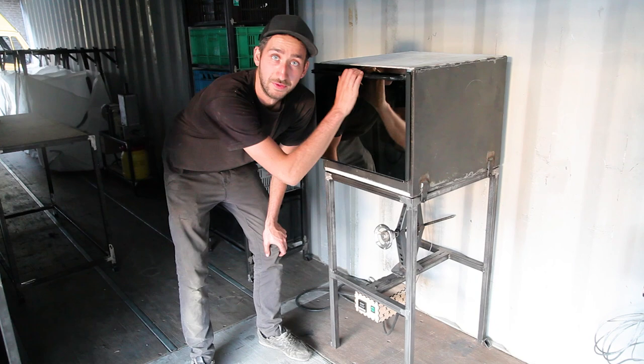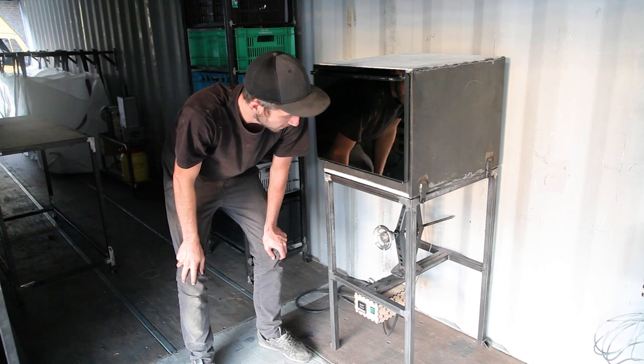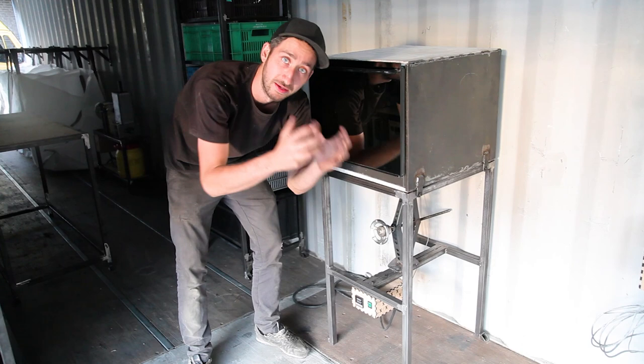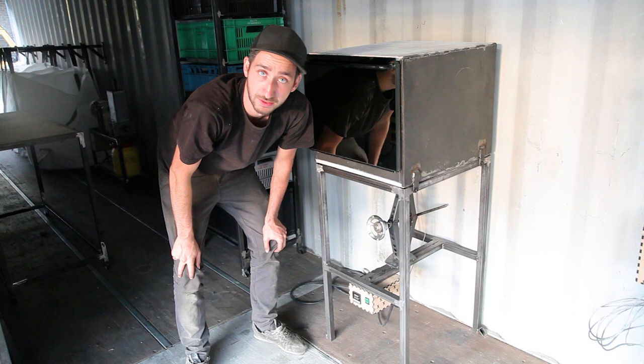Alright, so here we have the compression machine. Also a few small changes compared to our version 2. The main difference is that the compression area is outside of the oven, which makes it easier to build, and you can be a bit more productive because you can swap in and out molds, which makes it faster. So version 2 is also still good, but this is just a small update. You can also find it in download kit.